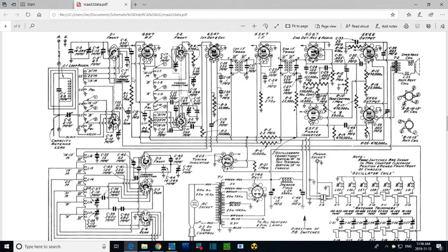I could go up here. This will give an even poorer idea of what the voltage is here, because now the pressure here has to work its way through 2 million ohms to get to your meter. The meter's 10 million, so you're losing 20-25% there.